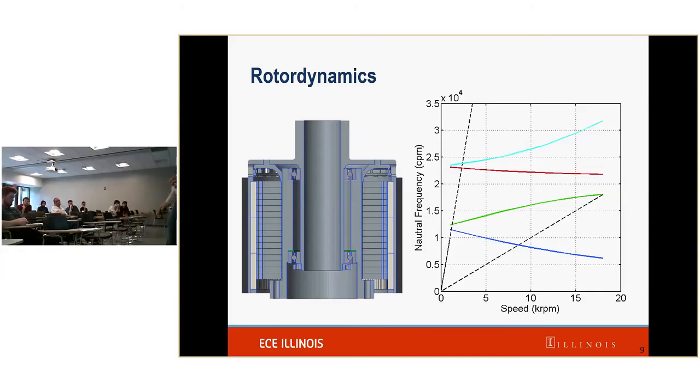Are you going to be able to do a test with the motor hanging? We can't actually do that. The greater the imbalance, the greater the amplitude it will excite. The thing is, we need to stay away from all of the amplitudes because we don't have the same back iron that a typical motor would, so we're staying away from all of them, even if we are in this orientation versus this orientation. Does that make sense?